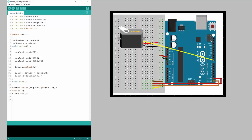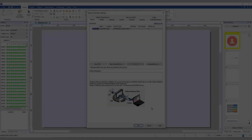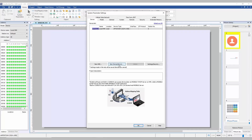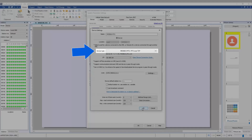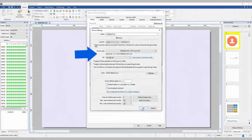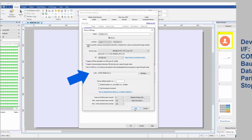I've put a wiring diagram on screen showcasing how I wired my project. All you need to know is that the servo will be connected to pin 8 and the wiring for the RS-485 connection will follow the same steps as our last video. To begin working on the EasyBuilder Pro project, we must first add the Arduino board as a new device by selecting the Modbus RTU over TCP option and setting the connection type to RS-485 2-wire connection through COM2. Pause here if you want to copy down my settings.